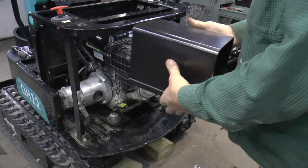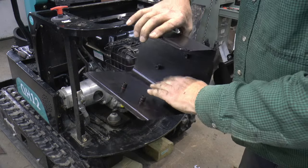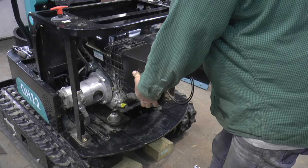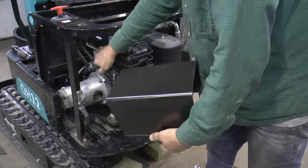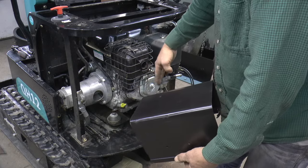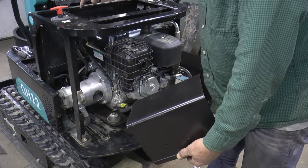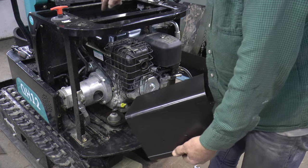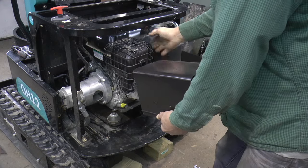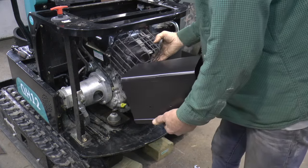What that's going to do — I'm not going to put it on there because these are temporarily held in place, and when I put it on permanently I don't want to knock them off. Anyways, this will go on this cage. It goes from the back of the cage and sticks out further so that it matches up with the holes in the back. Hopefully the air coming in here with my extra two fans will blow through this and back out, and keep some of this heat from the muffler out of the engine compartment.